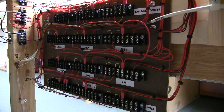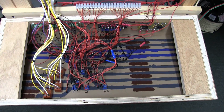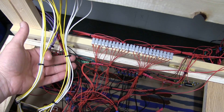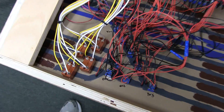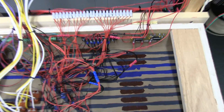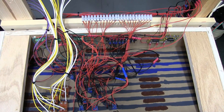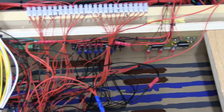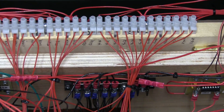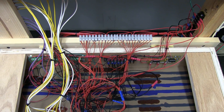All right, let's go take a look at Pittsfield, which is not done but is in process. Oh, sorry — before Pittsfield, here's the inside of Eugene West. Again, these are the cables for the power coming from the layout, through the switches that go out to the engine terminal tracks. So that's the inside — very similar: the three-card LED circuit, the SMC-12 on the corner, a large ground block, and the Euro blocks where all the LED positives go, then down to the board in the back where appropriate.